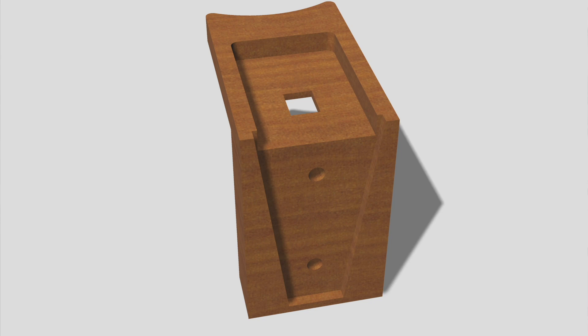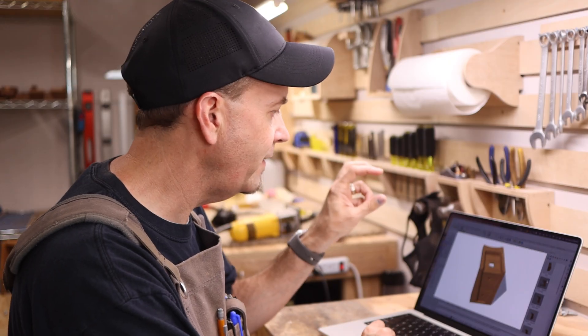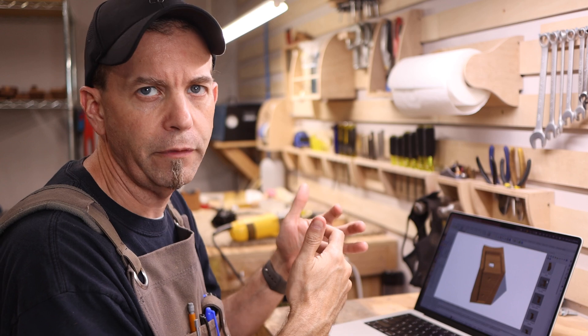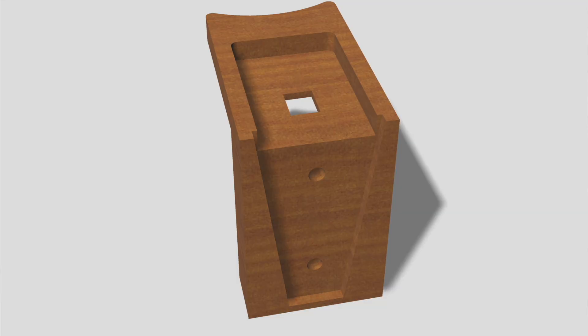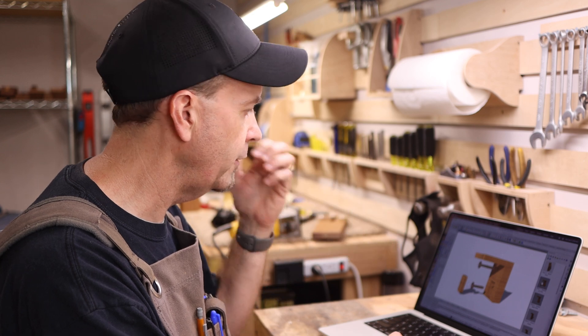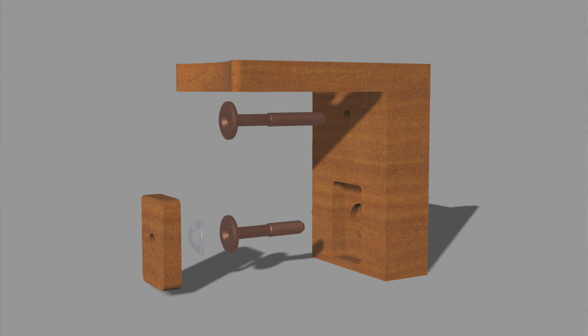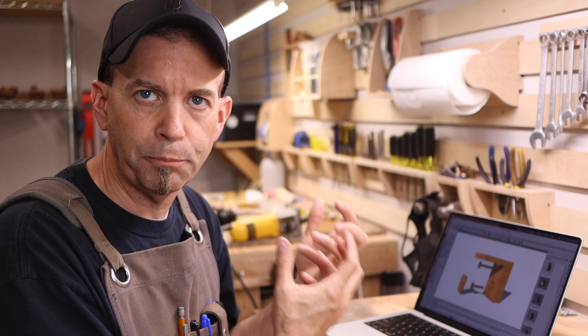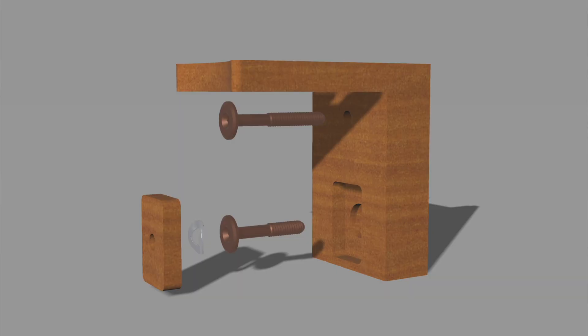What we've got here is a two-block setup. We've got a top piece and a bottom piece that are essentially shaped into an L — both pieces of hardwood, typically mahogany. We've got a pocket in the top and a pocket in the bottom one. The idea is you're creating a recess so we can move the neck without seeing the edges as we make adjustments. We're using a couple of furniture bolts: the top one is a straight bolt that goes through the block and into the neck. The bottom bolt is cut short and fits into a recessed pocket, with a wave washer sitting on the head of the bolt, and then a cap on top of all that — creating what we call a captive bolt setup. That wave washer acts like a spring so there's no unwanted movement when we compress everything together.